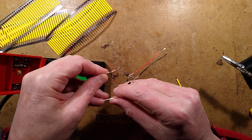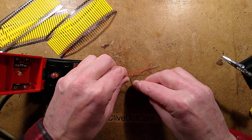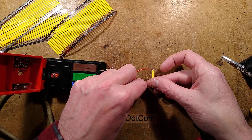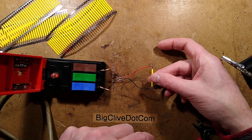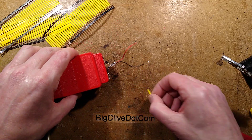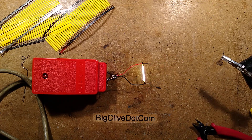In go the two resistors. This is not live yet — it's a Clive Quick Test, a sort of lab and workshop type test device. I want this wire over here and this wire over here. I shall balance a filament between them — I think this is the correct polarity. This is not normally how you test LED filaments, though when you see some of the factories in China it's pretty much how they do it, with bare connections and little ladies poking these things across. Here is the first test — it lit! Excellent.